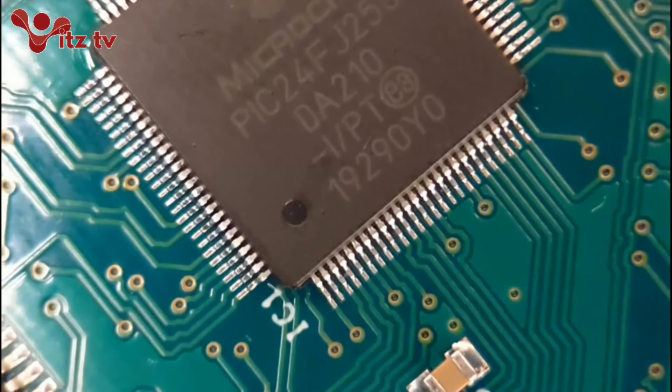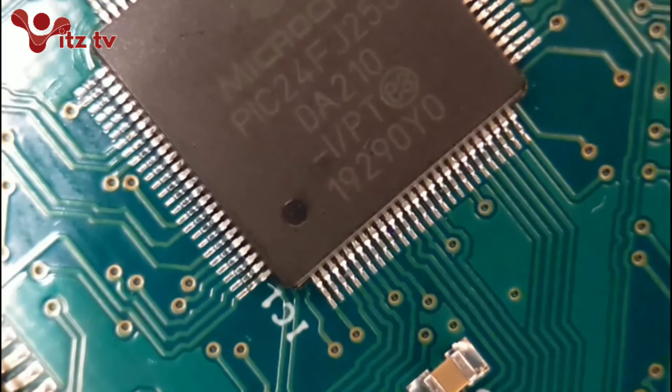Just wanted to record this little extra video for this last IC. At the start of the video I think I said it was called a QFN - it's actually a QFP. A QFN has no leads, and this one's obviously got leads, so this is actually a QFP. Just wanted to correct that. Also, a couple of other points - you can get yourself some 0.25mm solder, that will really aid you when fitting these. It's available from a company I use called BLT Circuits based in England. Also, one other thing that's really helpful is to get yourself a small conical tip for your iron - you can struggle with a big tip doing pin by pin, so a fine conical tip makes it a lot easier.